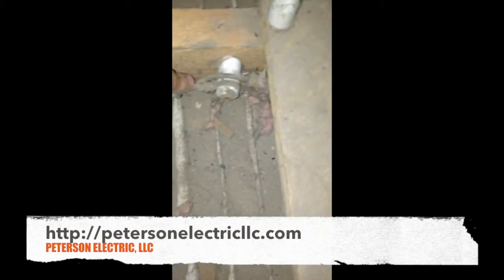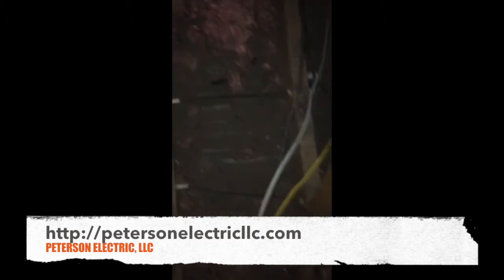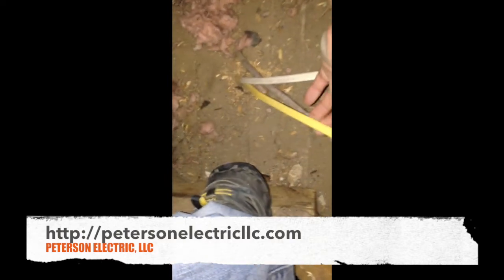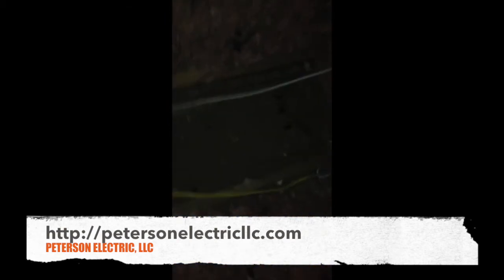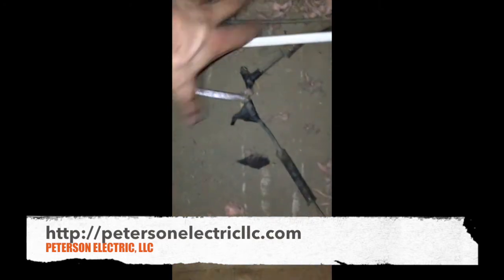The other knob and tube porcelain are these guys — it's a knob and two wire, neutral next to the hot in the same bay. Coming around, I labeled all my boxes from above. Here's your branch circuit inside. Here's some new wire going down — yellow and white. This guy didn't know what he was doing. He used all his white as hot on 14 gauge, and put a 12 gauge for a switch leg going to one light. This power is still hot. It comes over and they split it in the cloth — they did that years ago. All the insulation was on this in dirt, wood. I found old wallpaper right on top of these splices from the 80s — that's when everybody did wallpaper.